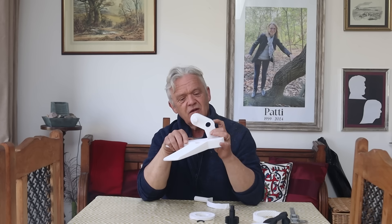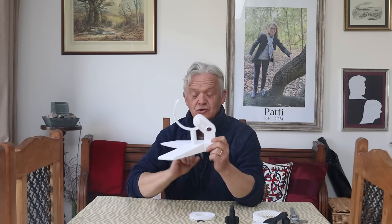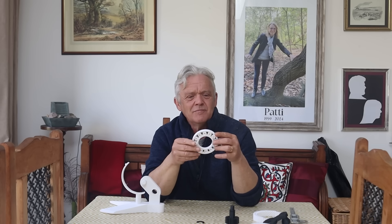The first thing is the stand, which is made out of three components: this arm, this arm, and a base. This arm goes into the base and gets glued in, and this arm goes into that hole in the base and gets glued down. The next thing is the outer ring - I wanted to show all three gear types, so I created this, which is kind of like a planetary gear arrangement. It actually looks more like a bearing, and it's print-in-place because the chevrons are set at 30 degrees and hold everything in place. When you spin it, it actually makes a pretty good bearing.